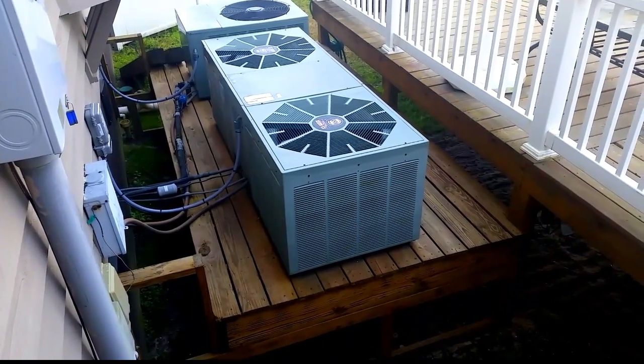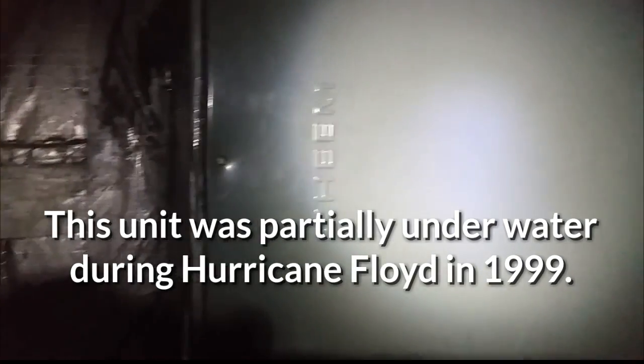Here's our air handler — we've seen it before in service videos. Zach HVAC has a video on us checking this system out. American Home Shield worked on it and really slaughtered it. Old Ruud, good stuff. I changed out the ductwork a few years ago — mostly hard pipe with a couple flex connectors, plus a 20-inch plenum on the supply. It splits into two 14-inch ducts, and there are two 14-inch returns as well.